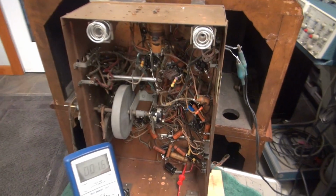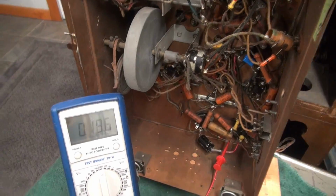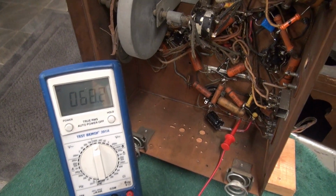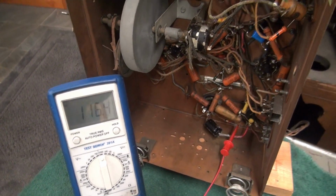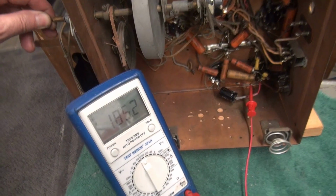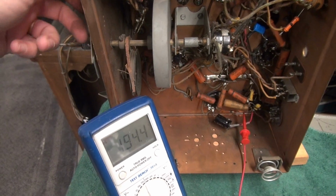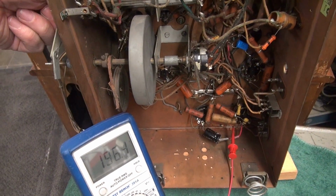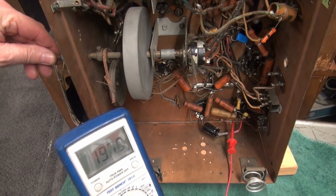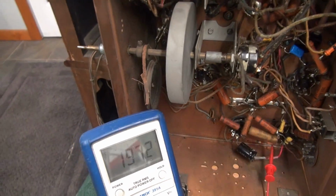Alright, I was able to temporarily remove the short. I'm going to turn on the variac. This was the line that was dead because of the short. Now we got some high voltage coming up. Good sign. Any signs of life? That's good. A little hum. It's better than nothing. Of course, remember my tuning doesn't work, but maybe.